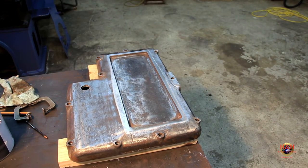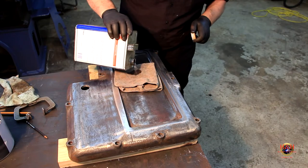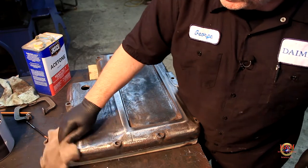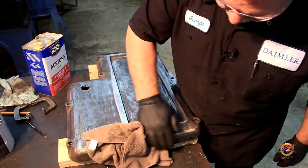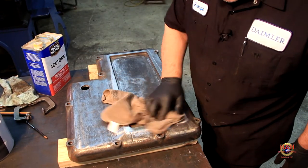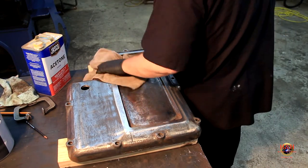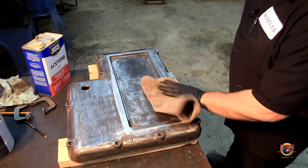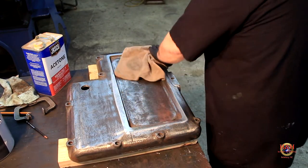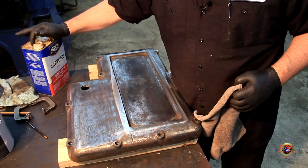Let me get a little acetone here. Doesn't take a lot. We just want to get most of the crap off of it so the paint adheres really good. So I did that on the lathe. In between coats on it, though, I took a regular handheld Scotch-Brite, like you use to scuff in between coats, and I went over the whole thing. So we still may do that with this one. I'm not sure. But I'm out of chip brushes, so I'm going to have to bust out one of the good ones. So I'm going to need this acetone so I can clean the paintbrush out.